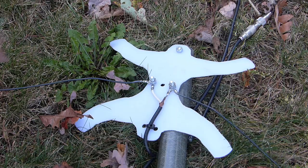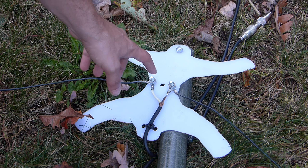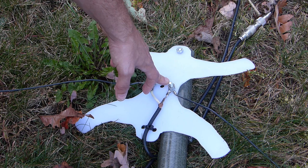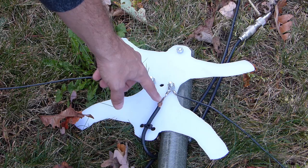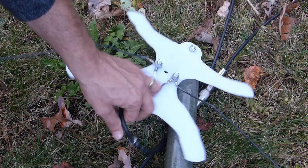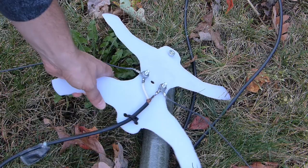If you haven't seen my previous videos on this antenna configuration, there'll be a couple of links down below. This is basically just a 40 and 20 meter linked dipole. This is the center insulator, made from an 88-cent Walmart cutting board that I just cut this pattern into. When I'm not using the antenna I wind up the legs onto either side for storage. I also have a short coax pigtail and a barrel connector to connect to a longer piece of coax going off to the radio, and it's attached at the top with one bolt so it can pivot around a little.